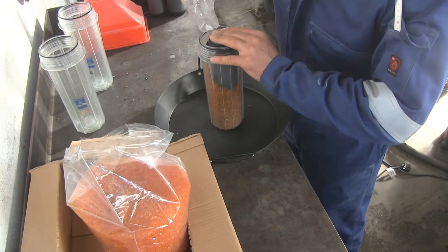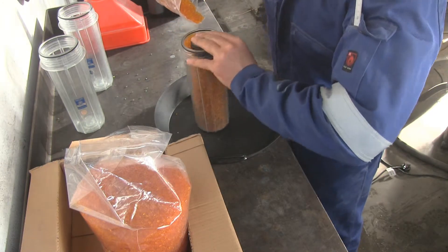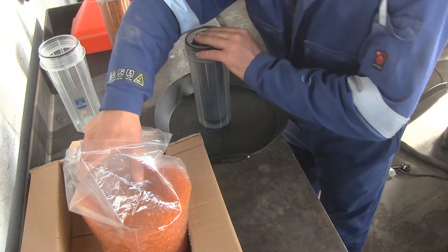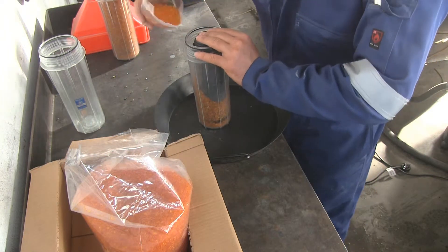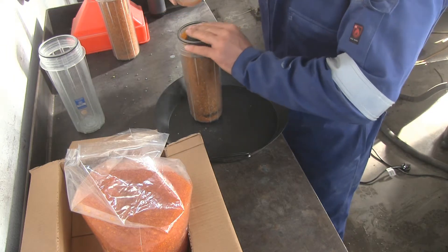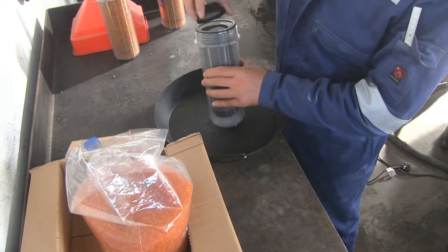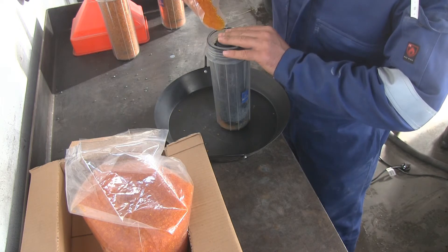The whole filter setup comes in different variations for import ports and so on. The working pressure is 6 bar, which is sufficient enough for painting or anything like that. As for how long it lasts, with a setup of 3 filters it lasts a substantially long time, especially considering I was also using it for running my shot blasting to shot blast the van and prepare the surface prior to painting. If you're interested in seeing more, there are links to the painting videos in the description.